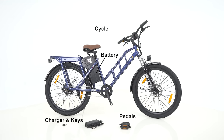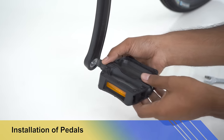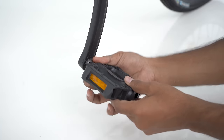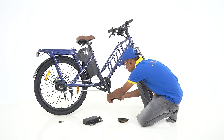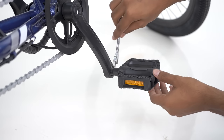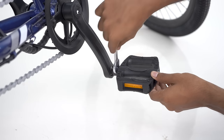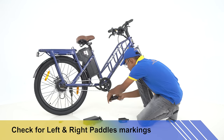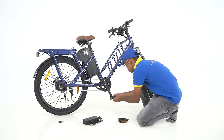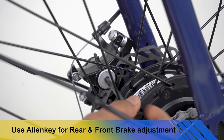You will get all the parts shown here. Paddles are marked with the symbol R and L, which means R for right side paddle and L for left side paddle. While installing the paddle, ensure to screw in the paddle completely inside the paddle arm by hand spin without using a spanner. Once the full screw thread is inside, tighten with the open-head spanner.